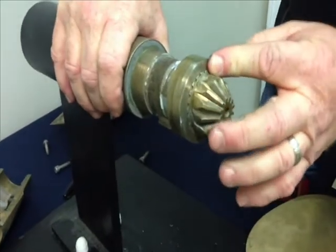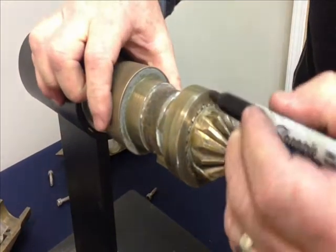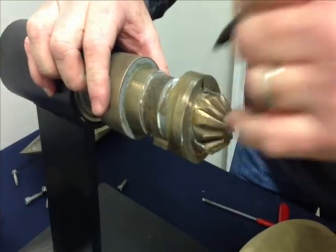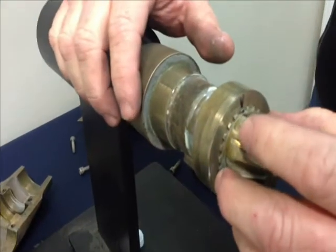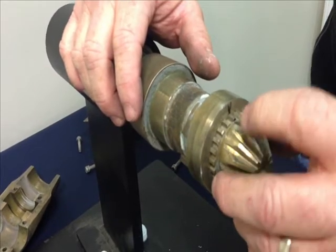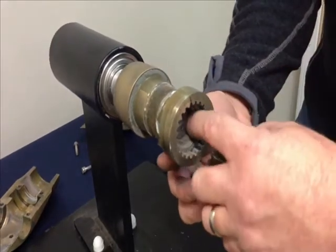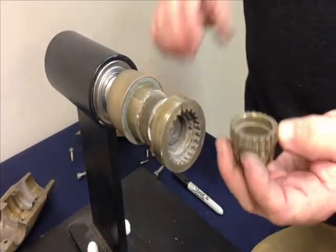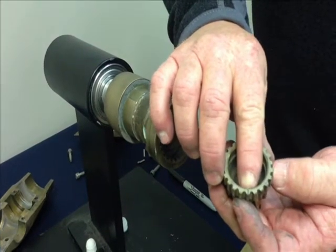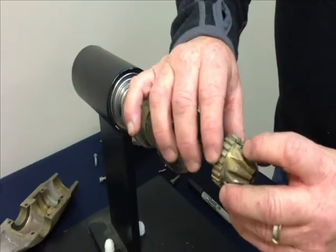In this situation, what I always do is start with K. Start with the letter K and draw a mark between the hub of the propeller and the cone gear. That way we have a reference point so that when we do pull it out, we can say okay, this is the tooth that it goes back into. At that point, we need to flip the cone gear over. Flip the cone gear over and determine where the X mark is — this groove in the central cone gear.